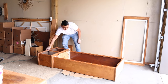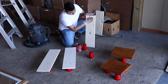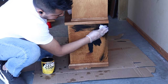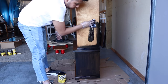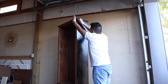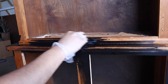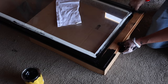I applied that to the rest of the interior before moving on to the exterior. For the exterior, I went with a black gel stain — this is my second time using gel stain. If you haven't used gel stain before, basically you can apply it on any finish that has or hasn't been stained. If you find a piece of furniture at the thrift store that you don't want to sand down, you can totally apply this over the entire surface — just make sure that it is clean. One tip is to apply two light coats. I would say what you put on is what you will get, so take your time, distribute it evenly, and go with the grain of the wood.